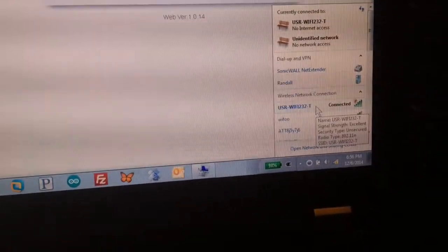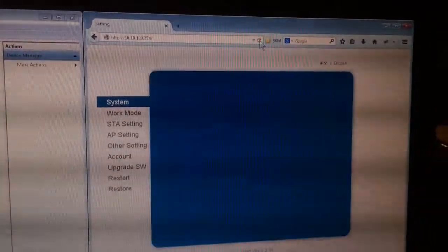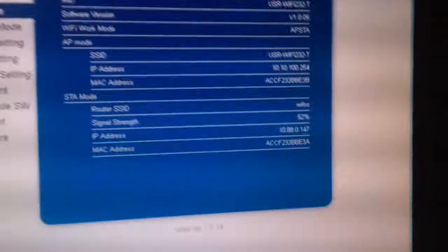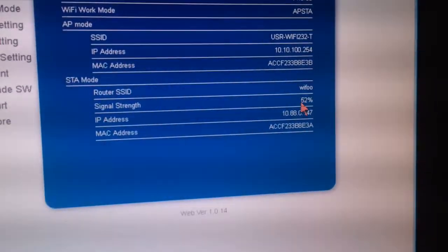Your computer may experience a disconnect due to the reboot, so if you click on one of the interface pages it'll say you won't be able to connect — that's just because the Wi-Fi hasn't reconnected yet. Give it a couple of seconds, then when you refresh the page it'll come back. Now you can see on the system page we are in fact connected to the local Wi-Fi network with 52% signal strength.